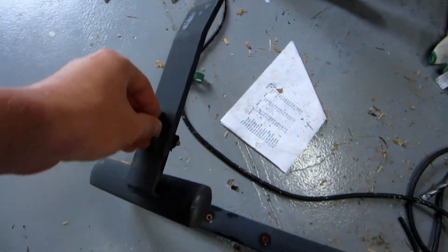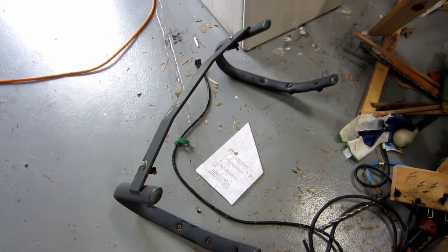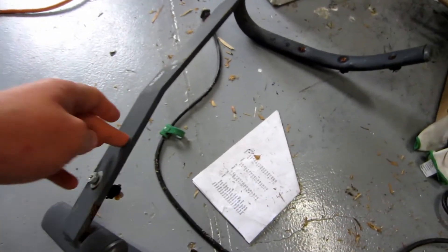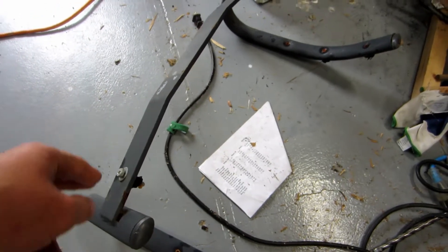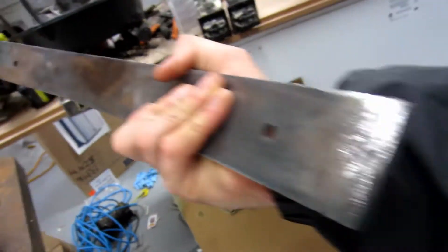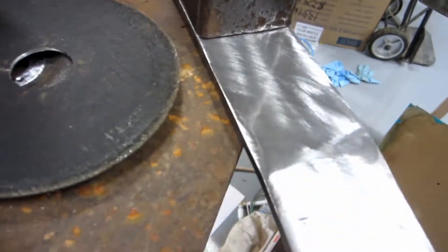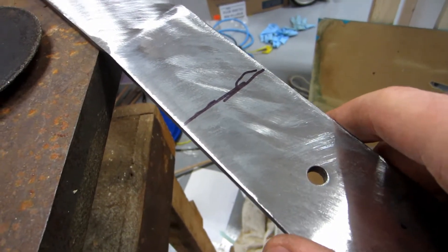Maybe the side mount I can fabricate out of this — it's some kind of office chair piece I found in the woods. I figure I can cut off this stuff, which is about a quarter inch thick where these arms are, and bend that over for mounting to the side. I have this bit from the office chair cut off and polished up with a flap disc, and I have this piece acting as a support. I'm going to be welding this side here. My next biggest challenge is I have to bend these to a right angle, and that's not going to be easy.